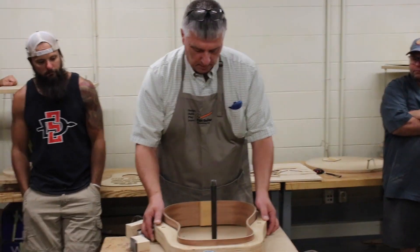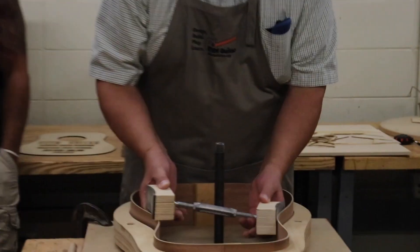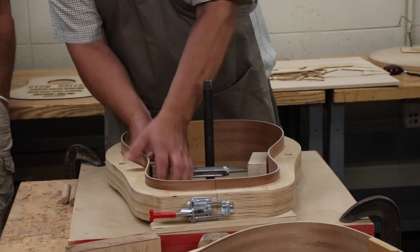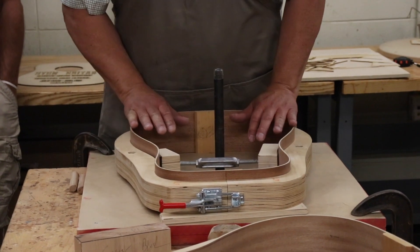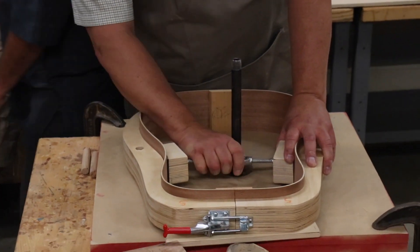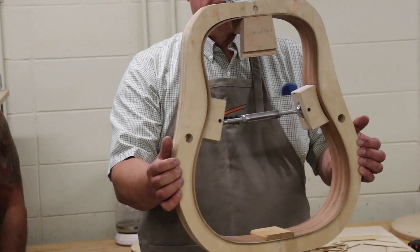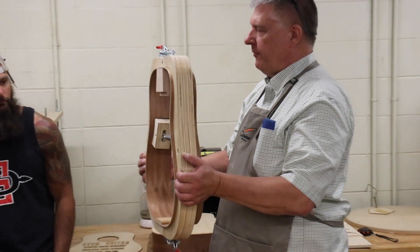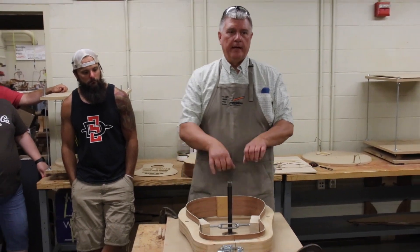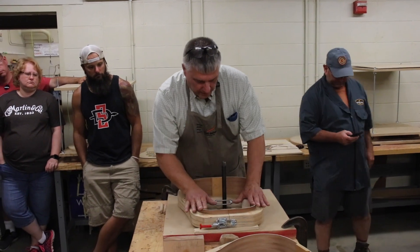The purpose is so I can press it out to get it to the shape that we want — the curves are all centered. Bring it in there, this is all the way down, and then I'm going to tighten this up and the gap's going away. By doing this it's pretty rigid now. If you're one of those three-letter companies that makes these clamps, what they use is basically a solid piece of MDF with spreaders in the middle — that's LMI. I have this pretty much ready to go.